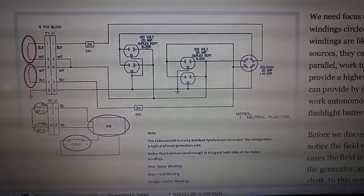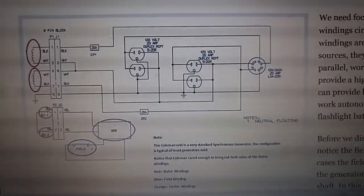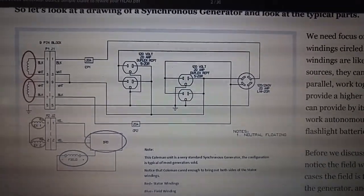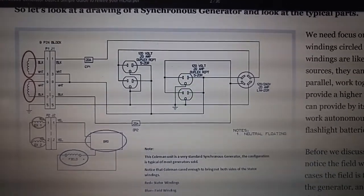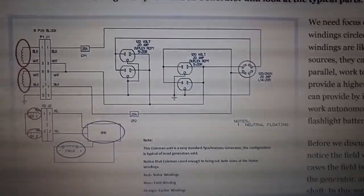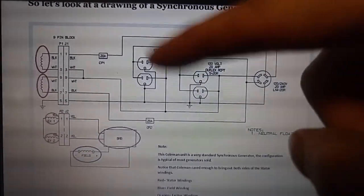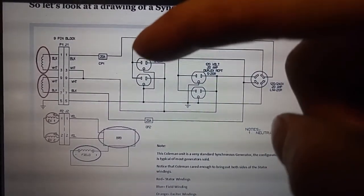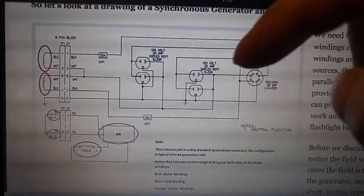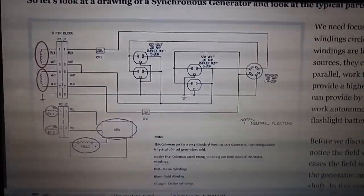What I like about it is he does kind of what Honda does, and he specifically talks about it. So it's exactly what I was thinking about and researching prior, which I recall clearly because I thought it was really interesting, and wondered about these different current ratings and breaker designs. One of the things, I wouldn't use a 120 amp breaker. I'd wire in, like I said, how they're designed already, with a breaker for each outlet and then a breaker for each leg of the 240 outlet.